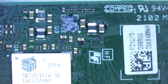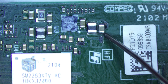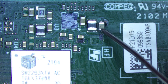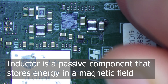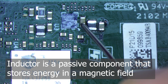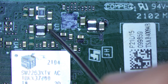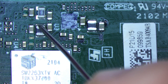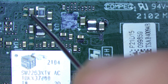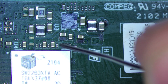I have the multimeter in beep test or short-circuit mode and we'll probe both sides. We get a beep on the ground side — that's good. We don't get a beep on the other side — also good. This inductor is no longer shorted to ground, and we'll check all the other caps too. They're perfect — ground, not ground — so it looks like that short circuit has disappeared.